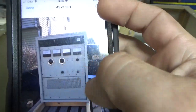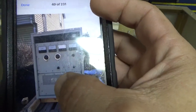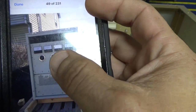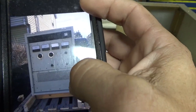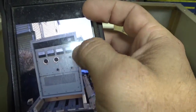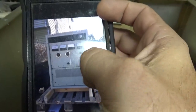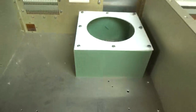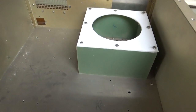So it's a rolling cart — the RF deck slides out on casters. All the power supply components will be down here. The blower is set up down here and pushes up, like I did with the six meter amp. The bottom half is not on casters; the whole cabinet is on casters and has outer panel pieces.